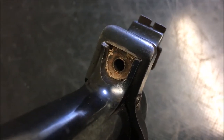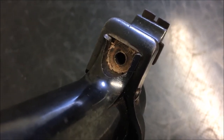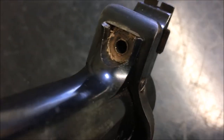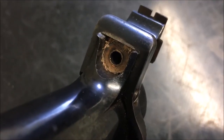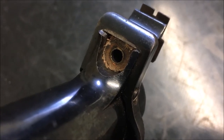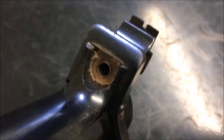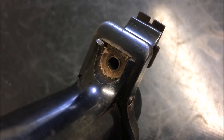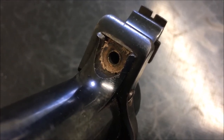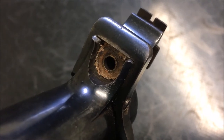I've already replaced the breech seal — I didn't film the actual installation, but the principle is the same so I'll explain everything I did. You'll see that the seal is a leather one with a brass insert; that's the traditional type installed in these pistols right from the start in 1935, and the same seals go through until 1964. There is also a rubber or silicone seal available on websites that sell air gun parts, which may actually be a bit more effective if you're just interested in shooting.